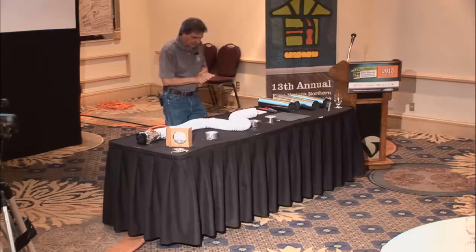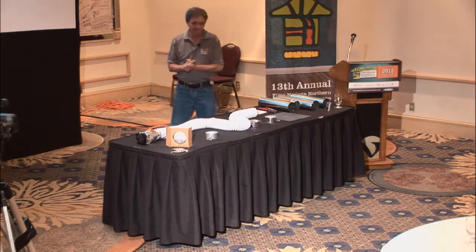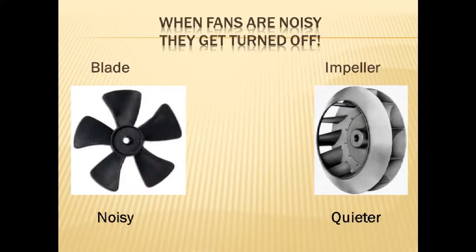Doesn't fit. It's like the bathrooms you saw at the early part of the show. You know, everybody says, well, they used to make doors that fit, and they don't anymore. That's because we want the air to move. That's why we cut the bottom of the door a little bit. Make sure the air can circulate and get out.